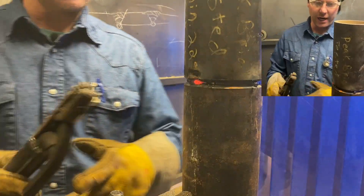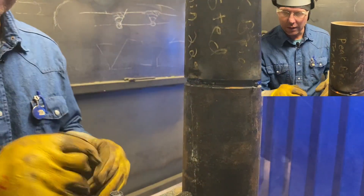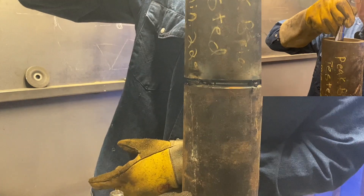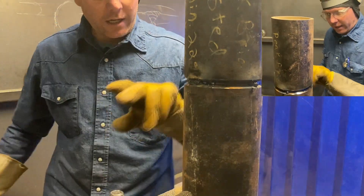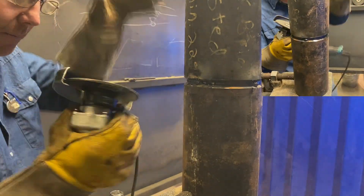Okay, here we made a tie-in. I didn't grind that tie-in because that was coming from a keyhole to a keyhole. Like I said before, I rarely grind those because they tend to have a little bit of a thin spot anyways. Those tie-ins look good. Now I'm going to knock down this little heavy spot here that I got to come into next just so I can keep it nice and smooth.